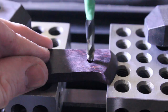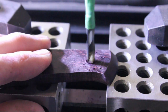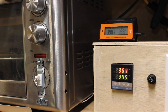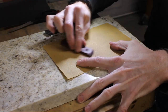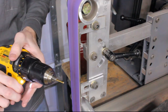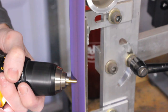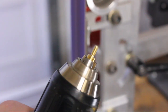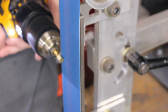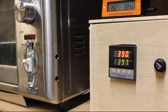While the knife is tempering, I work on the handle. This is a homemade countersink bit I made for Corbys — the center fits into the number 12 hole and makes a nice step. I go about 3/16 of an inch into a quarter inch scale, leaving about a 1/16 inch ledge for the Corby fastener to sit on. I then flatten the scales on a granite block. I trim the Corby fasteners down, shooting for around 0.31 inches on the inside-to-inside measurement.